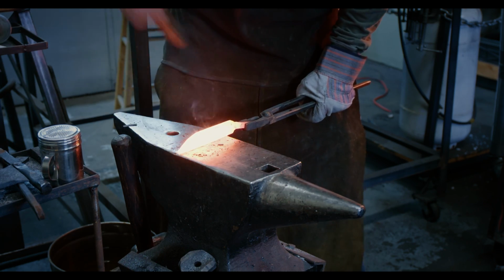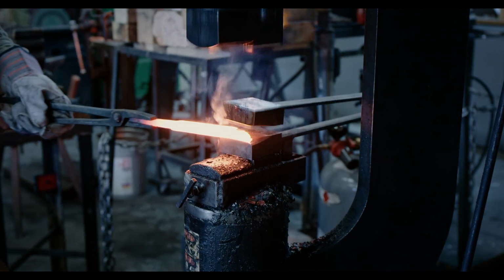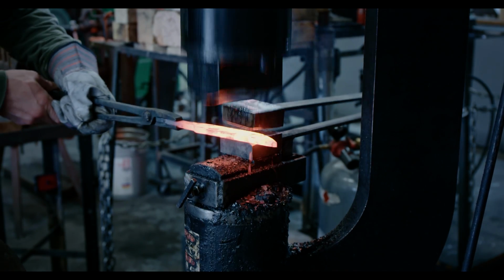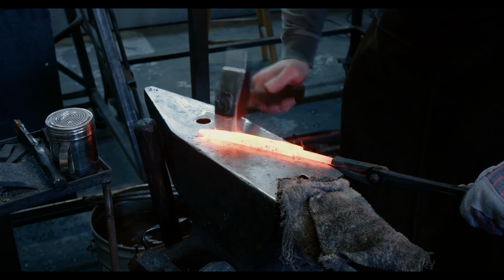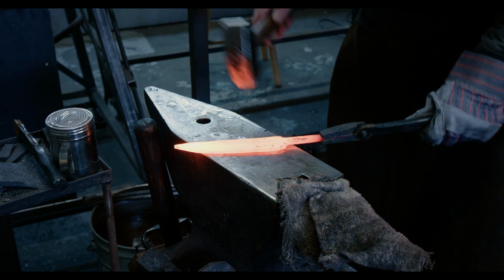While the steel is now in the basic shape of a knife, the edge and back are of the same thickness. The jig on the power hammer helps to bevel the edge and also elongates the wolf's tooth pattern. Finish forging with a wet anvil helps with blowing off scale from the steel. This sometimes makes impressive sounds, but I did not capture that in this video.